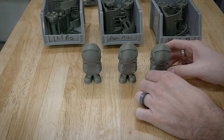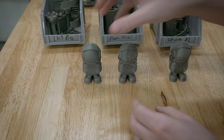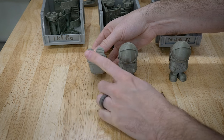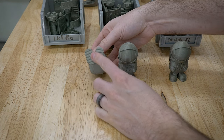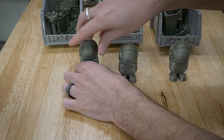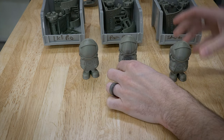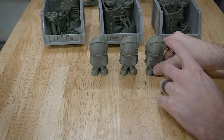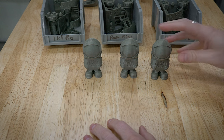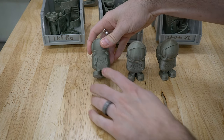Next up we've got the Matterhackers Astronaut, and they're all actually very similar so I won't spend a lot of time on them. The feet printed pretty good. There's a little bit of gaps in the filament — really just bed leveling, which is really hard to get perfect on there. Underneath the hands there's a little overhang that printed pretty good. Compared to the Prusa Mini, it's okay — they're all about the same. There's a little bit more zitting and blobbing on the Sidewinder X2, but overall all three are pretty good with nothing major. There's just a tiny bit of ringing visible in the logo.